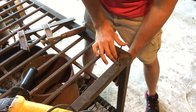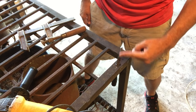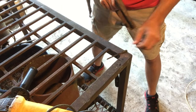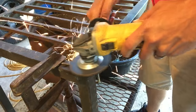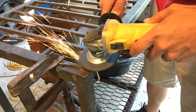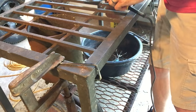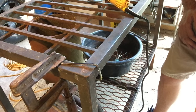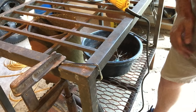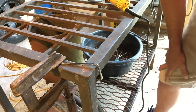I'll show you how I build it and how it works. I'm just gonna put it on my little table here and clamp it down. If you had a vise it'd probably work better — I just need to clamp it to this surface so I can flatten that edge out. Super easy, not a lot to it. Just be careful you don't shave off too much material or you'll end up with a piece of metal that's too thin and it'll break on you. You're just gonna flatten out both sides and make it just a thin piece of flat metal — that's all you're trying to do.